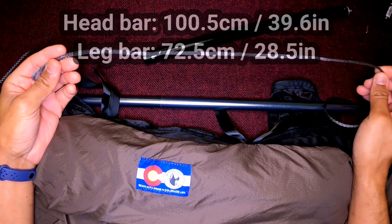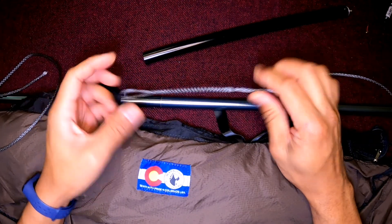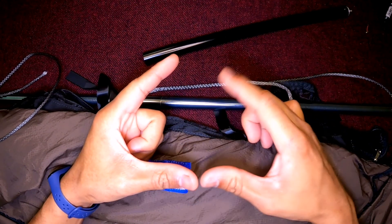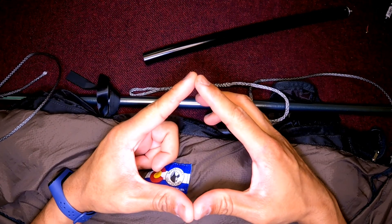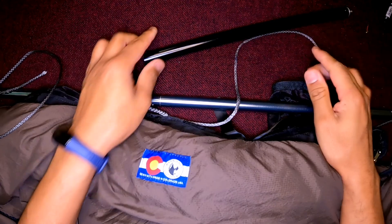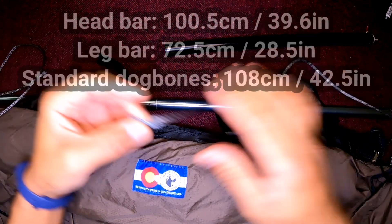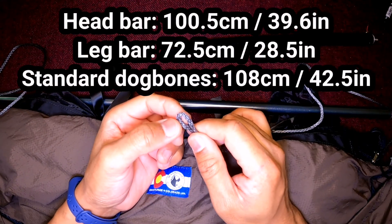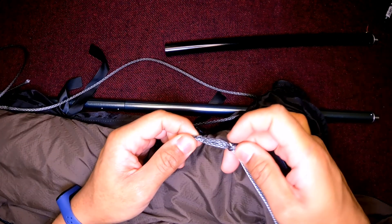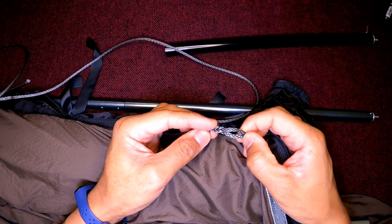When the dog bones are installed on the head side, they basically form an equilateral triangle — meaning all three sides, the two dog bones and the spreader bar, are of equal length, more or less. The ratio is about 1.01, which is negligible. These are about 108 centimeters long from the tip of the dog bone to the tip of the eye splice just before the knot.